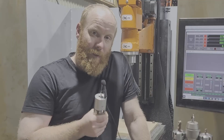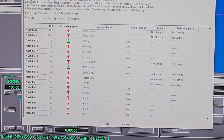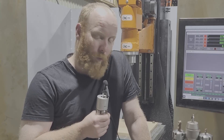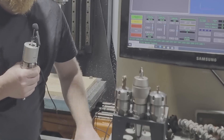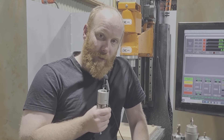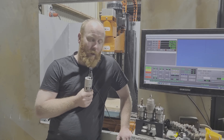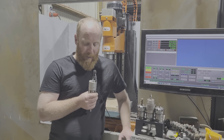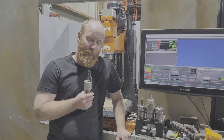As you can see, the setup is quite simple — just set up a couple of pins as inputs, set up the board that comes with the machine, plug it into the ethernet and then into the C82 board, and you've got a simple way of probing in parts and setting tool offsets for your different size tools. I'm pretty pleased with the probes. Once again, thanks Arturo from CNC for PC for supplying me with the touch probe and tool setter — really appreciate the support. If you haven't already, head over to CNC for PC and check out what they've got. If you'd like to see more of the touch probes, tools, and CNC machine in action, make sure you subscribe. Thanks for watching.